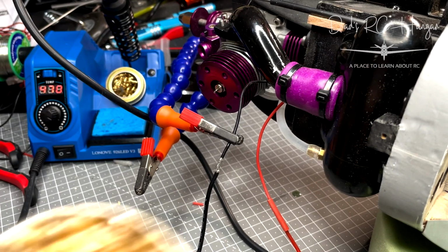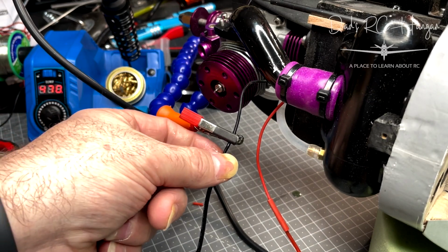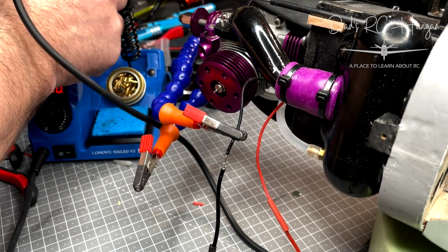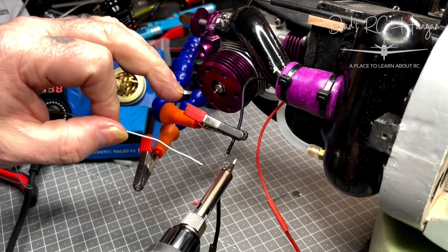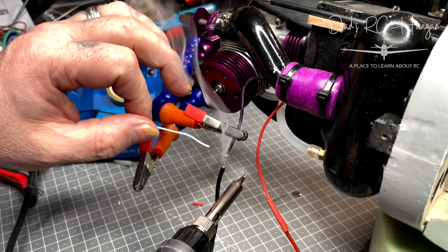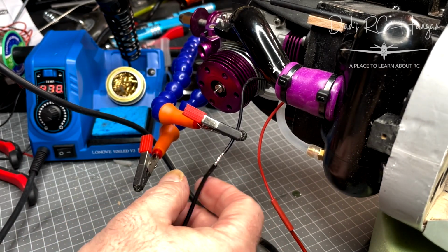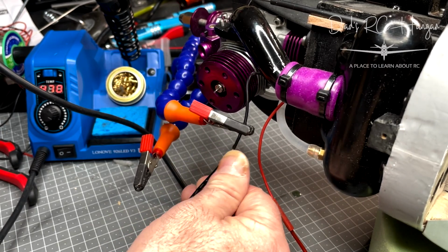And then once again, I'm going to get a bit of flux. I mean, there's lots of flux in your solder, but I just like to put that bit extra because when you touch it with your fingers, as I say, you can stop it from adhering and all sorts of weird stuff and get dry solder joints and everything else. So let's just push this to, oh look at that, beautiful, beautiful. Wipe it. Now also just a note for solder, people are not really soldered that much. See, I've got a lovely shiny solder joint there, lovely and shiny. That's what you want it to be.